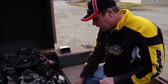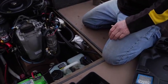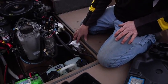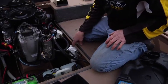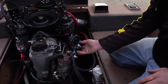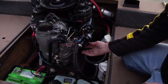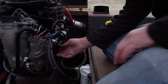But you have to get it out of this system if you do indeed ingest water into the tank, or you left your cap open, or for some reason you had water in the gas. Once it goes beyond this filter, it goes up into your lift pump, past the small inline filter, and then it's going to feed into your main onboard water separator filter.